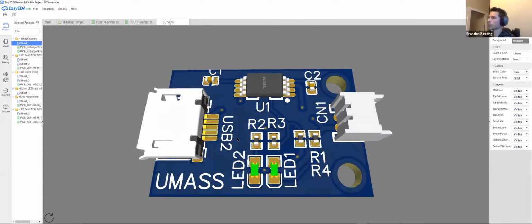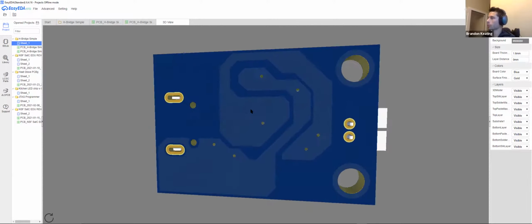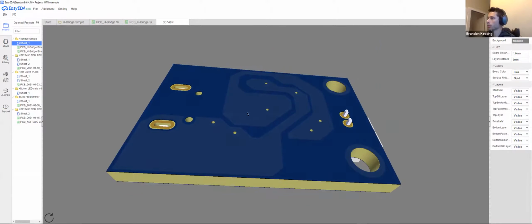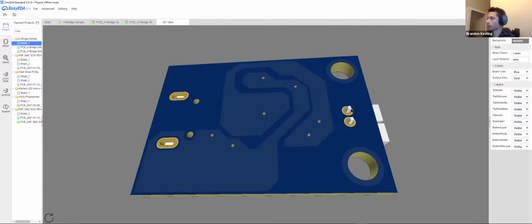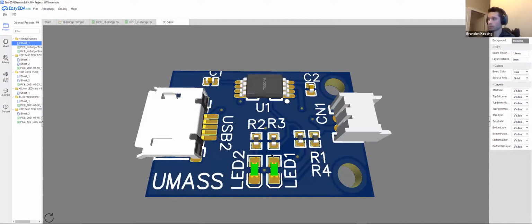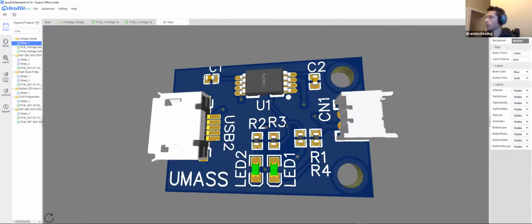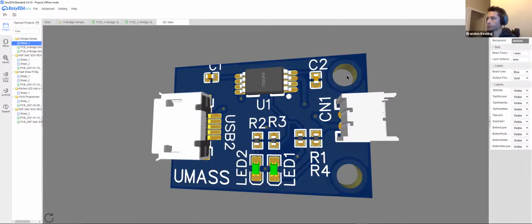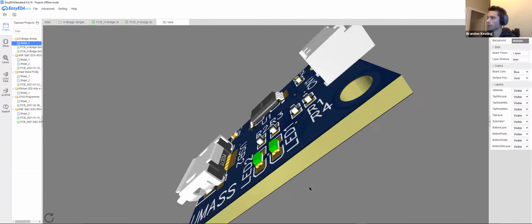And this is absolutely everything. So we have two through hole components. Here we see our ground, or both of our power planes. The through hole, so you would actually likely solder this yourself. Sometimes they'll put it on. Generally, if it shows up in this preview, they'll put it on for you. But we just left a couple of holes for maybe screwing this into something, or if it gets mounted on another module, because this is going to be entirely flat.